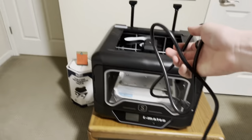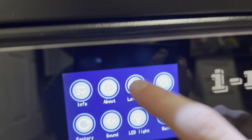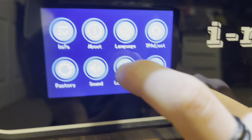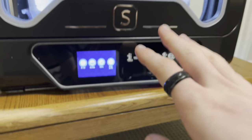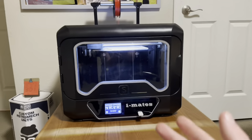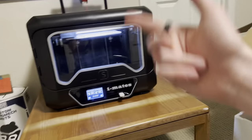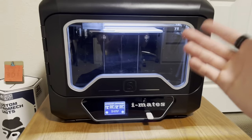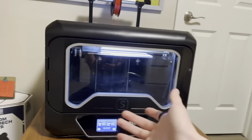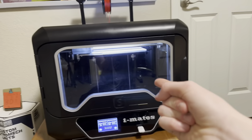I did what I said — I ripped out the power cord. It's pretty easy. Let's move it to the table. Now let's just plug it in. Let me demonstrate through some settings — going to language, English. Looks like everything's good. Now I ran into a bit of an issue: I have it set up and it looks really sleek, but these bearings were in the middle and I don't think they were supposed to be there. Basically, I couldn't make the build plate go higher because these bearings were stopping it. I had to actually cut through the foam to get it started. That could be a problem for you, so I just wanted to let you know — it is possible to get through it, though.